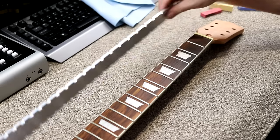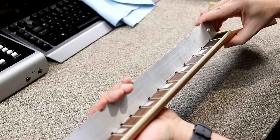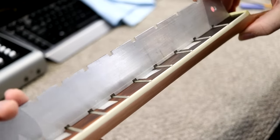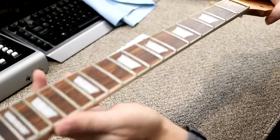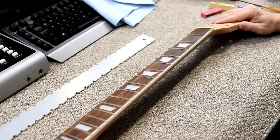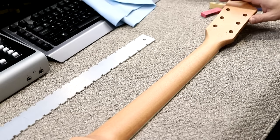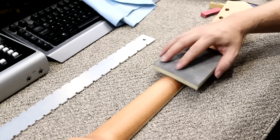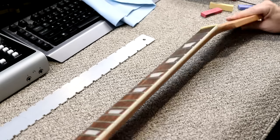Now let's move on to the neck. Let's see how this thing shipped — I'm going to check with my straight edge here. That is dead straight. You'll notice there's no gaps between the straight edge and the fingerboard throughout the middle of the neck. Obviously once you put the tension of strings on there that will change, but that's dead straight, which is good for doing any sort of work on the frets. You want to make sure your neck is straight. So what we're going to do is sand some of the coating off in preparation for doing our own. We're just going to give it a nice sanding in preparation for putting on our coating — I'll do that out in the garage.